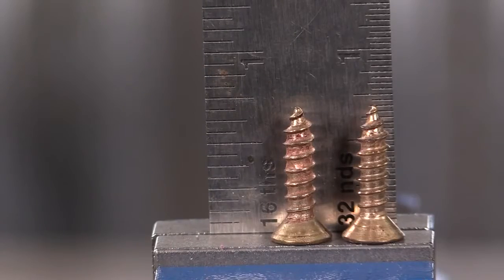Almost all residential doors operate under the false pretense of security, when in reality they're about cheap manufacture, ease of installation, and thermal efficiency. In addition to flimsy wood jambs, most of the hardware that holds and locks your door uses tiny three-quarter inch screws — just enough to keep the door from falling off the frame, let alone stopping unintended forces from kicking it down.